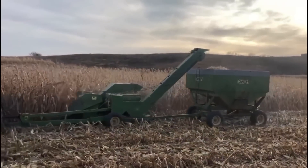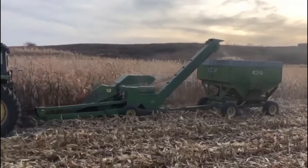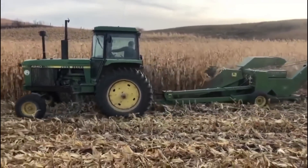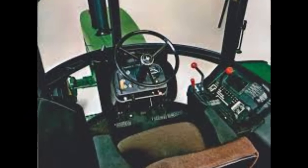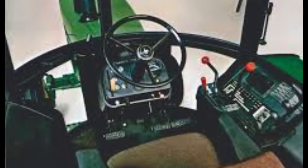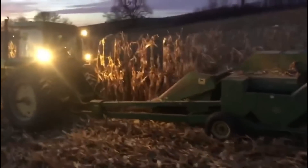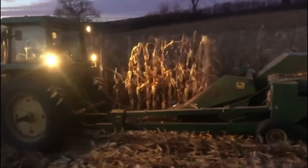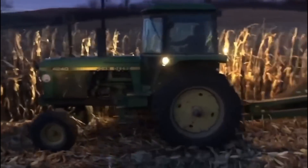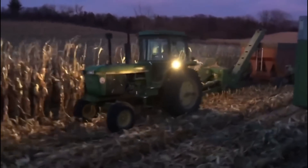One of the best cabs in the day was the John Deere Soundguard, and they kept the same body for the 4440 but improved small things to make it an even quieter place to work. They added more foam and different upholstery in different spots, along with the availability of an upgraded seat. For just over three hundred dollars you could have the seat upgraded to a hydro cushion suspension seat. These seats would use accumulators charged with nitrogen to keep a better ride while going across rough terrain. One thing that was changed at the end of the first production year of the 4440 was the rear axle size — they increased it by about six millimeters.